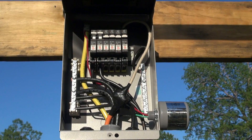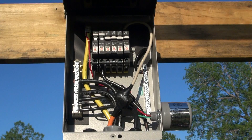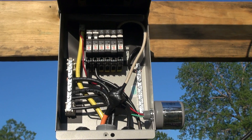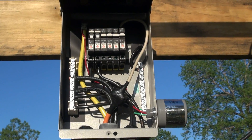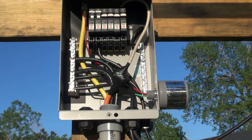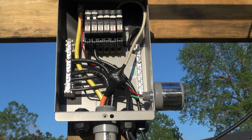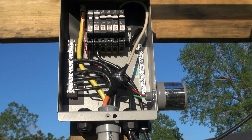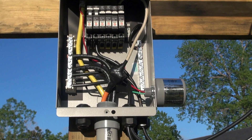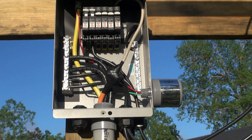There's going to be five strings because Outback said I can only have 2,000 watts. So the first five breakers — one, two, three, four, five — they're going to be for my main solar for Outback. That sixth one, there's a big white wire that comes out of it and goes down into that big black bundle. That's a split ring, and it goes down to a two-gauge orange. So it's six-gauge on top to connect to the breaker, down to a split ring, and it's all clamped down, taped — I used not just electrical tape but the big thick insulation tape, and then electrical tape on top of that. So that should be good.